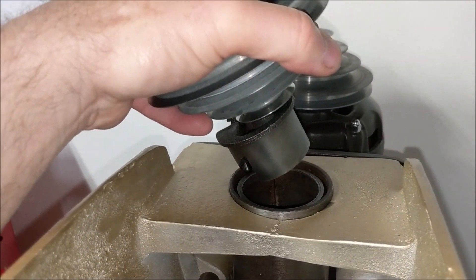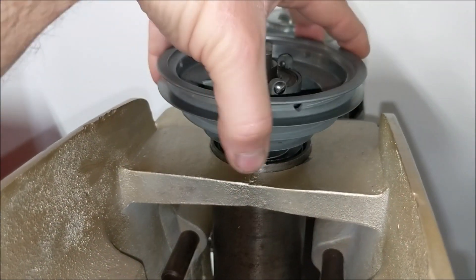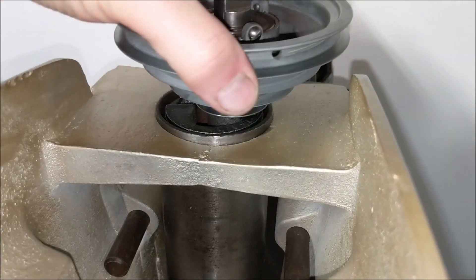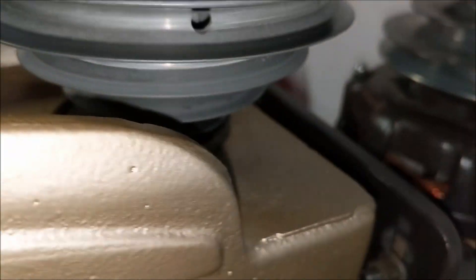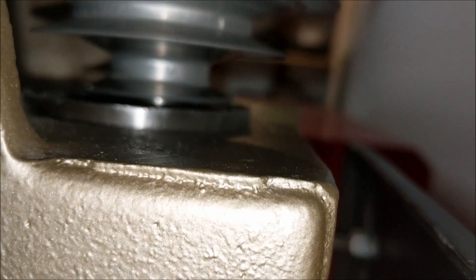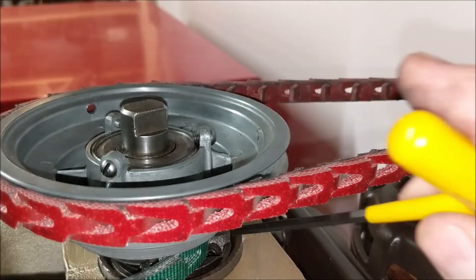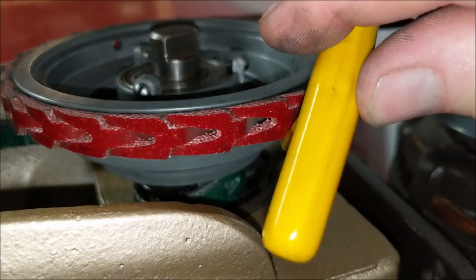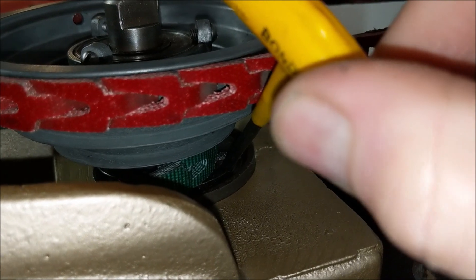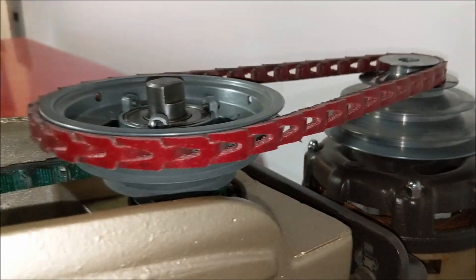With it in place it will fit the Craftsman 100 and 150. And if you disregard the collar and just put the MSA in, it will fit a Craftsman 80, the smaller diameter. Here you can see that it is offset, and of course that is to facilitate belt changes and for tightening. You'll want to check that the lowest sheave is not riding on the cast iron body. Once it is in, you'll grab your 5/32nd hex and tighten it down. It does not need to be too tight — it is driving into that cast iron outer collar.